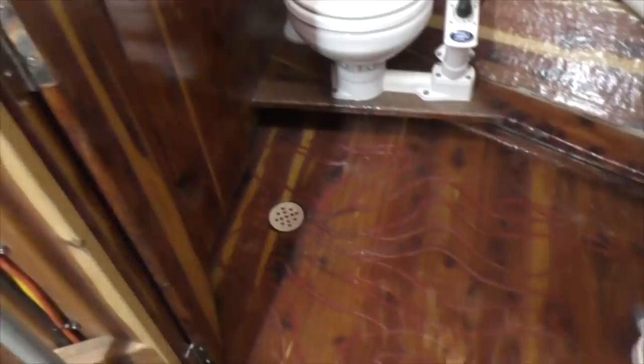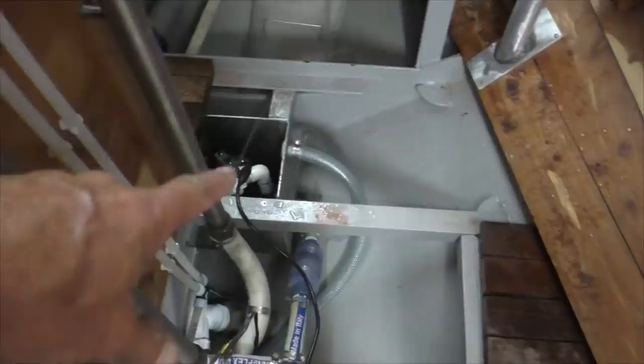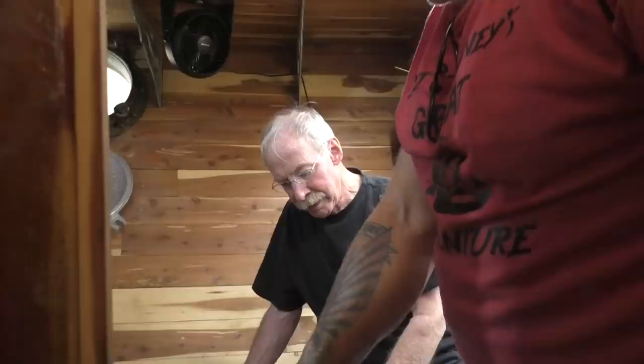There's a little drip in here - I took the hose off and left it, not a good idea. Did you check the forward toilet? Yeah it's fine. Because this one is not fine. We went to lunch and it drained in here and filled it up - we had that clamp off to work on it because of a little leak. When the bilge pump kicked on it pumped it into the loop and right back into the boat. Where's the river water coming from? From that valve down there, which is shut. Was it shut? Hell yes it was shut, because it wasn't pumping over that hose or we would have sunk the boat. So that toilet uses river water - it's definitely river water color.